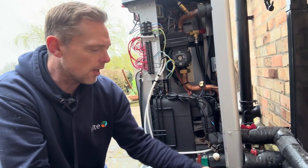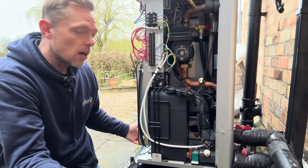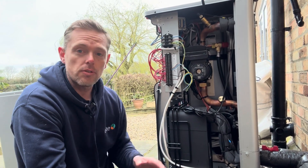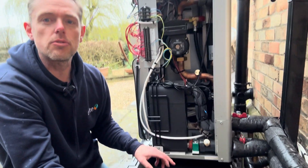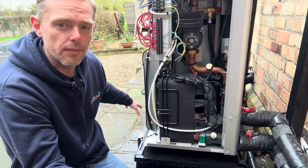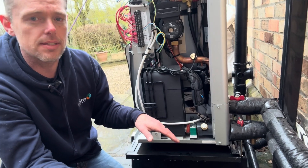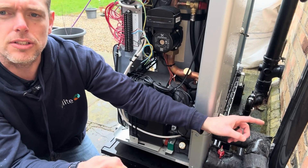The first thing I've noticed outside is the drip tray is already completely full. Daikin's drip tray design isn't great - I think on their new units they're looking at bunging up the bottom like other units that drain away better. They've kind of had to makeshift this drip tray on the bottom of these ones. Ideally you'd put some sort of base or paving at a steep downward angle to get the condensate away - but as you can see here there's an upward slope at the back, so it's never going to drain properly anyway.